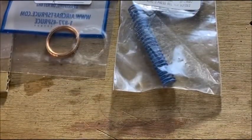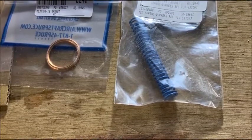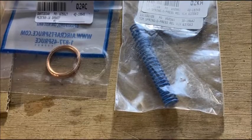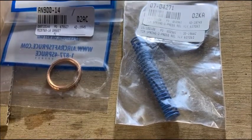It looked like the seat might be dirty, so we lapped it thoroughly. A new spring and extra shims were inserted. A second run-up followed.